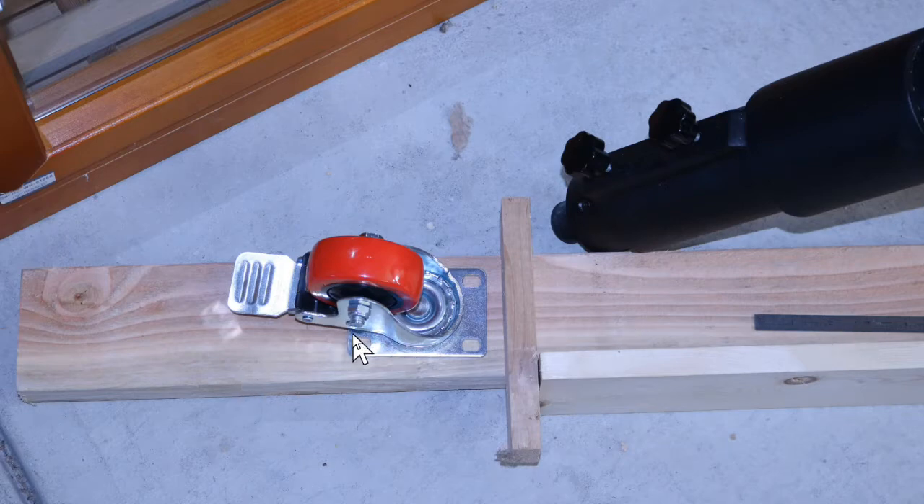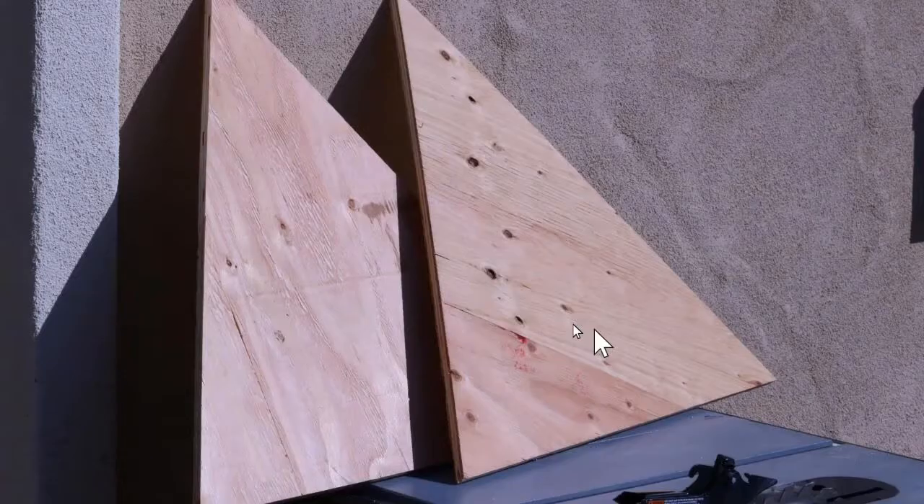You can take all these things off the top, pick this up, and do the rest of the jobs using your miter saw and workbench. You might want to do these one at a time so you don't get confused. Pick up one of the boards, cut it to its final length with your miter saw, put it on your workbench, and mount the wood pieces where you've marked them. Don't mount the wheels now — we'll mount them later.